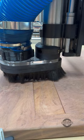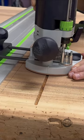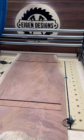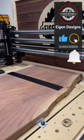For smaller slabs, the inlay can be created using a CNC like you see me doing here, or alternatively you can use a straight edge and a hand router to create the same effect. By creating a slotted pocket on the underside of your piece, you're able to effectively bury the C-channel in the workpiece so that it isn't visible once your piece is fully assembled.